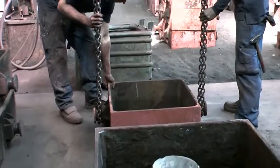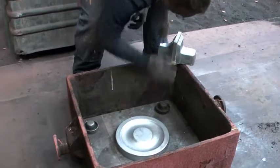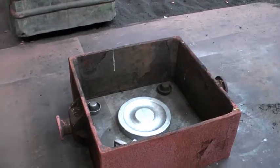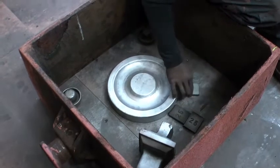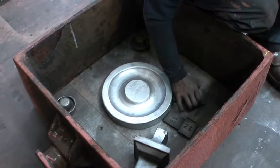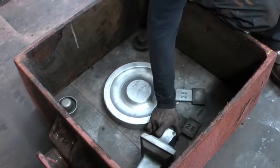The bottom half of the molding box or flask is set onto the floor, where one part of the pattern is laying. The oddly shaped block in the corner will form a cavity to hold a special filter to keep the slag out. The other blocks are sprue patterns — they form the channels which will lead the molten iron to the mold cavity.